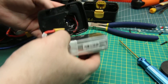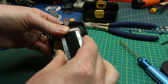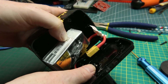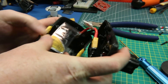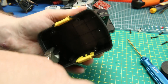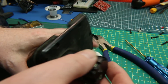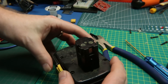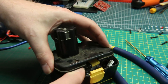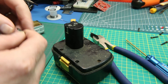I'll clean up this mess and you should be good to go. Plugged in our 1300 — this is one of the weaker packs from my quadcopters, but it works good enough for this. We'll plug it in, set it into place. It would be good to put that temperature sensor against the pack. The bigger danger here is going to be me being dumb and running the pack dead. We're going to have to take a chunk out of there to make some room if we're going to use this cover. You can easily modify this and put your LiPo monitor in there — your balance checker and battery monitor — they're about two bucks if you don't already have them. I can link everything you'll need down below. We have a functional pack — I'll throw one screw in it just for giggles and we'll test it out.